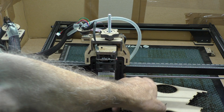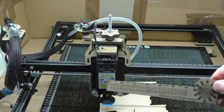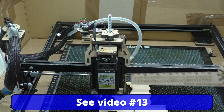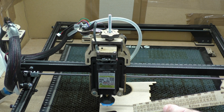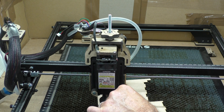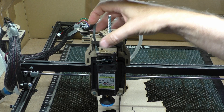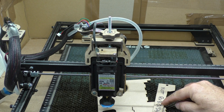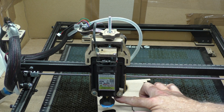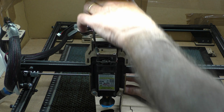The way you focus now is: put your material on here. As you may know, I use my focus gauge — video link in the description. My focus is 21mm, so I put my gauge on there, then I wind the focusing down and it falls under its own weight. The gauge is resting on the bottom of the back plate — the back plate that goes up and down — so I hold that in there.